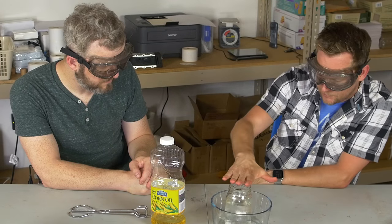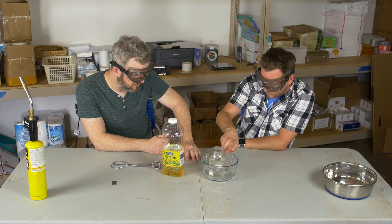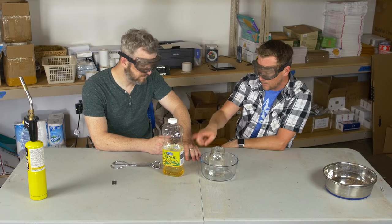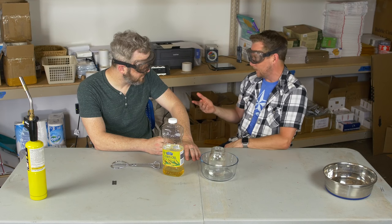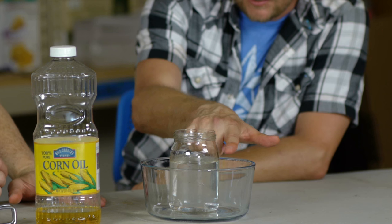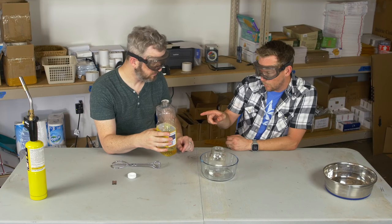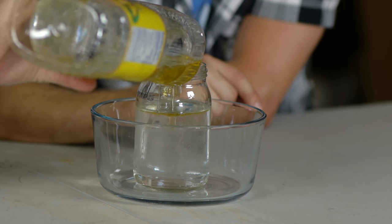According to the video, our intended outcome is to transform this mason jar into a tumbler glass. You could fill the bowl with water up to the line that you want to crack it at, or you could do it from the inside. But the important ingredient is that you add something that has a much, much higher boiling point than water. Corn oil is going to boil at around 475 degrees. All the oils will boil at different temperatures, but since the water will never get hotter than 212 Fahrenheit or 100 degrees Celsius, the oil can get very, very hot — you'll have a very precise band of thermal discrepancy where it stresses the glass and hopefully shatters it. My suspicion is that less is more. We want as thin a band as possible on that corn oil, and you've got to make sure it's touching all of the sides or this will not work.